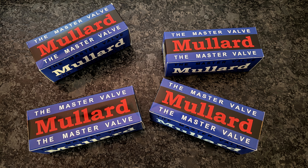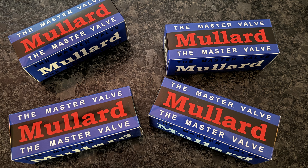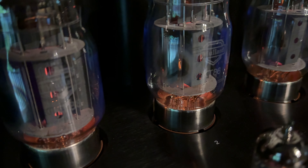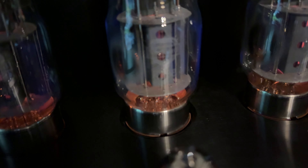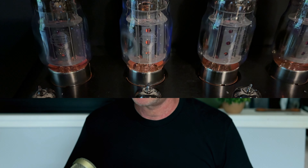I've always used Mullard tubes in my phono stage — they're known for a warm sound that accentuates the midrange and tames the treble. I have some new old stock Mullards I bought a year or two ago and also some new production Mullards, which aren't quite the same as NOS but still carry a semblance of that sound. I replaced the PS Vane KT88s with new production Mullards, and after they broke in, the sound was even more to my liking.